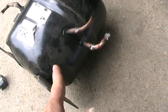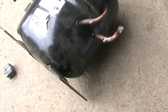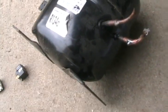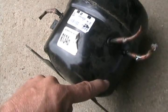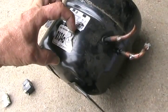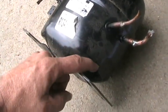Some compressors have two extra tubes down low on them — fairly small ones — and sometimes they're used and sometimes they're not. They're not actually connected to anything inside the compressor. There's just a loop, like a hollow tube, that goes underneath the oil level in there. The oil level is usually a couple inches deep, and it's called an oil cooler tube.